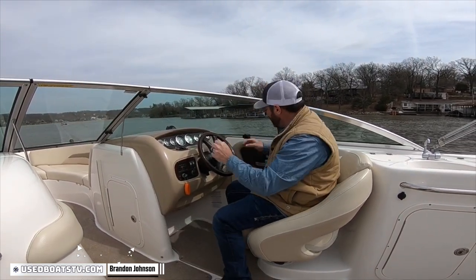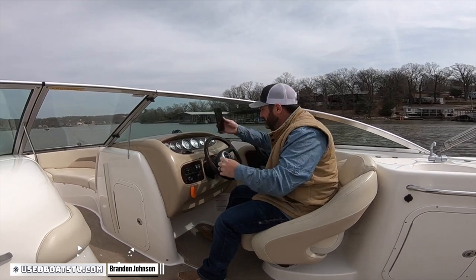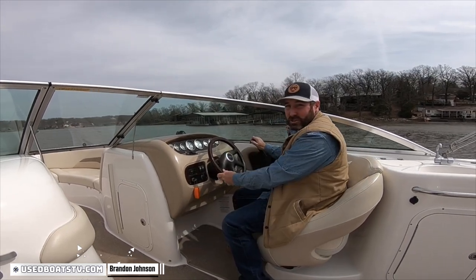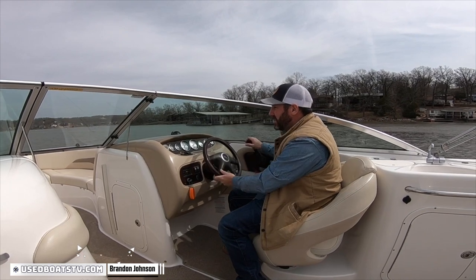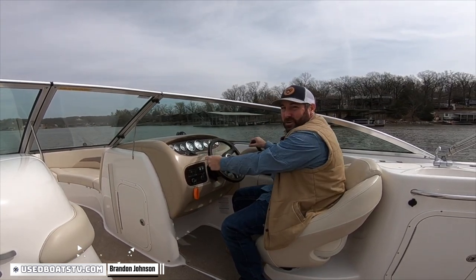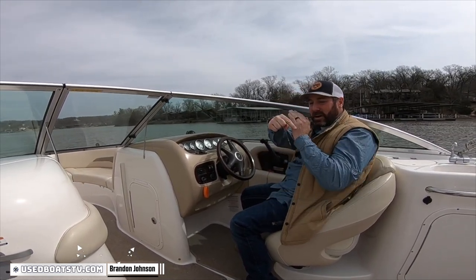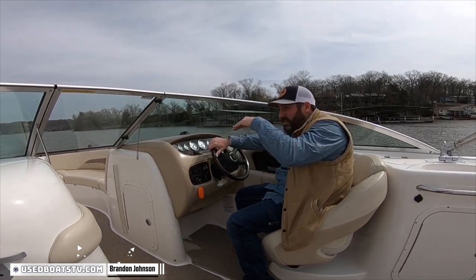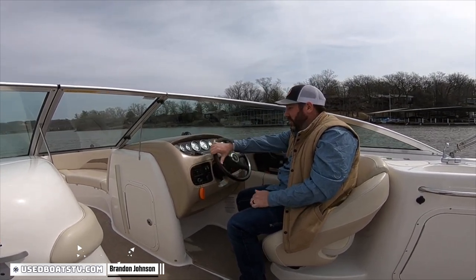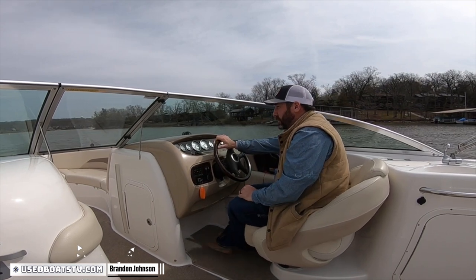Your tilt and trim for the out drive is right here on the shifter. I've had a lot of customers that are excited to drive — as they accelerate, they trim up. The trim is the out drive of the propellers. They're accelerating, accelerating, and the boat's not going anywhere because the propellers came out of the water. So don't do that. You always want to start off trimmed down. With the props in the water at a negative angle, it keeps the rear end of the boat lifted and drives the nose down. Doing water sports, maneuvering — that's the best way. Just trim down. When you're going to cruise, you want to trim up. Refer to the video in the description that explains how to find your perfect cruise and how to operate tilt and trim.